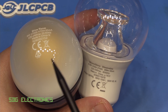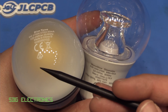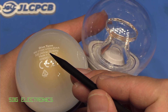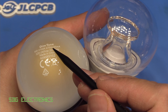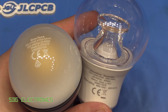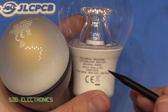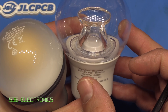Just a couple of interesting points about these lamps. Philips originally introduced these remote phosphor lights as part of a challenge to see who could make the highest efficiency AC retrofit lamp. Things have apparently come a long way since then — this one is rated for about 470 lumens with an AC current of 65 milliamps. On the newer lamps, we're getting almost double the amount of light for less current, at 45 milliamps. Things have really come a long way with these very small surface-mount white LEDs.